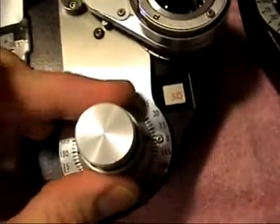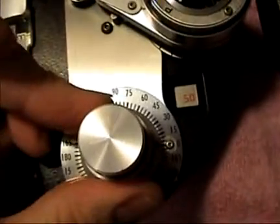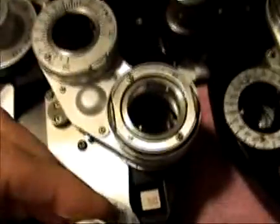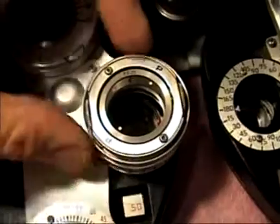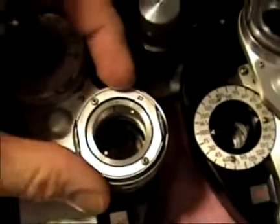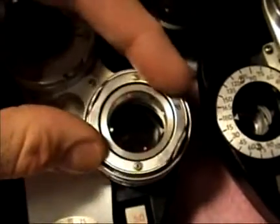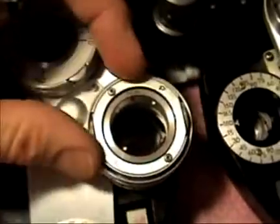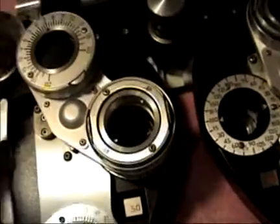This is a synchronized cross cylinder, a feature that's been around for well over 30 years. When you turn this knob it turns this lens by a similar amount. As the lubrication inside this lens mechanism dries out, it gets more and more resistance moving from one position to another, and when you flip the lens it can cause the axis to rotate. It's necessary to lubricate this internal mechanism so it moves more freely and doesn't cause the axis to dislocate when flipped. That requires some disassembly.